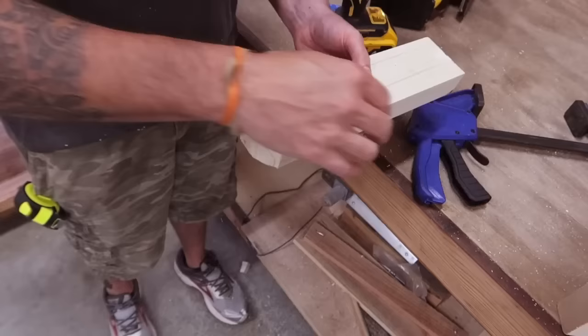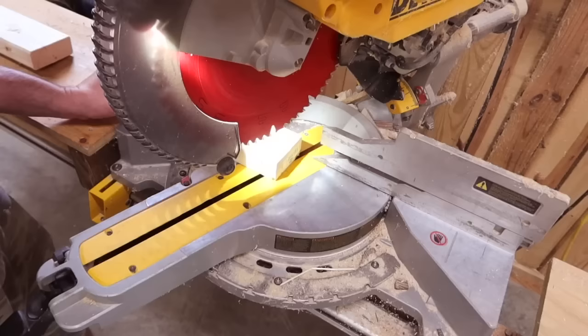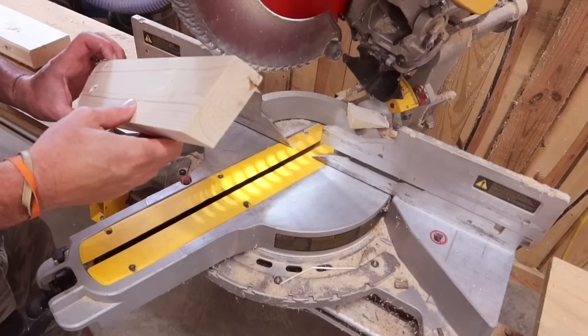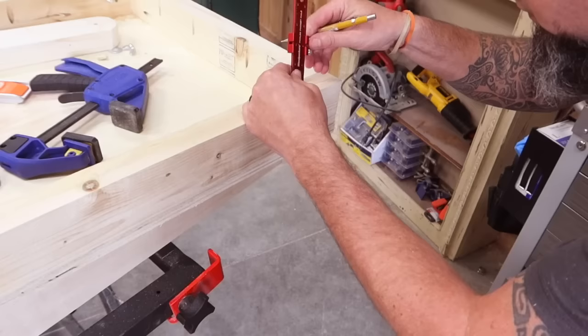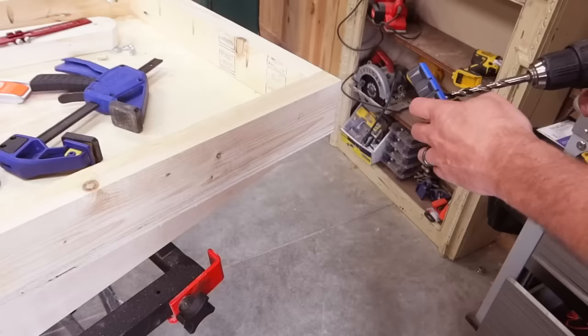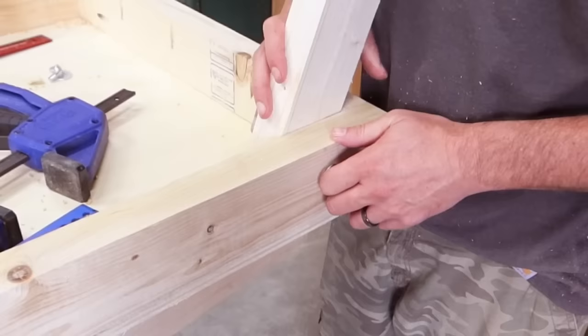For anyone wondering, this is part labeled D in the list. For our bolt hole, we'll be using a three-eighths-inch bit, and with Kreg's drill guide this makes for a perfectly straight hole. Now let's head over to the miter saw and put our angle on the end of this board — this will make sure our cornhole board sits perfectly level. This cut is made at 28.5 degrees off center. Now let's cut our bolt holes on the boards: the bolt hole needs to be three-and-a-half inches in and one-and-a-quarter inches down. It is very important that these holes are drilled straight or your cornhole board will not sit level.